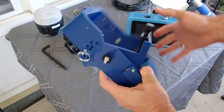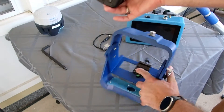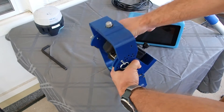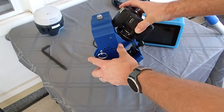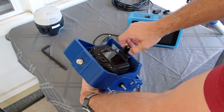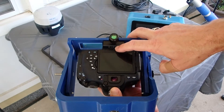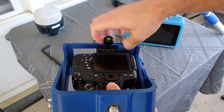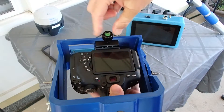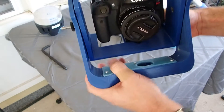To mount the camera, it has a tripod plate on the bottom that mates with the tripod connector in the frame. Put the camera in so that it will eventually be looking down. The knob of the retainer is at the back, and on the tripod connector and retainer there are a series of gradations. Line up the tripod connector on the zero mark and then tighten down the thumb screw at the back to lock in the camera.